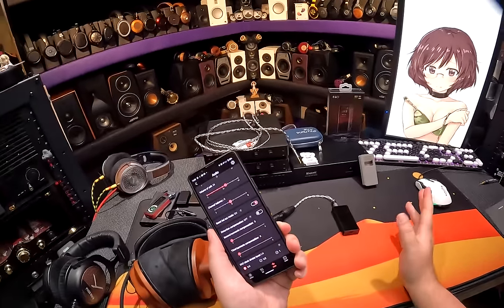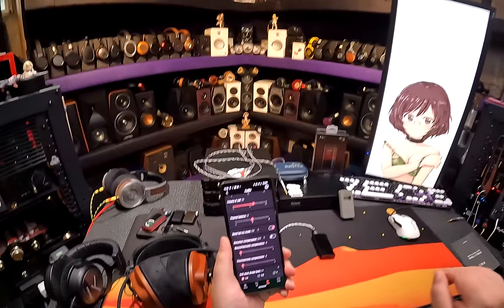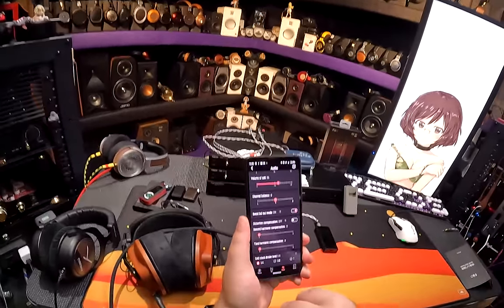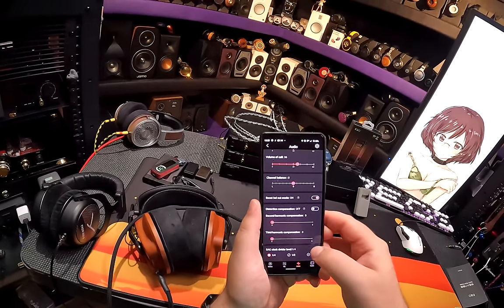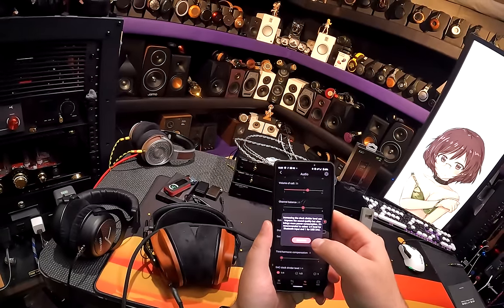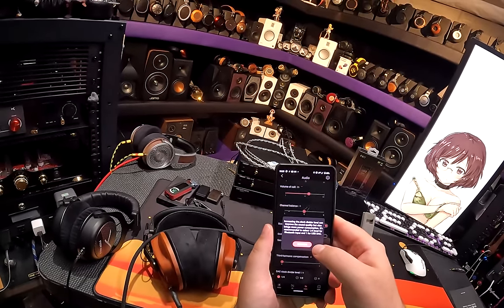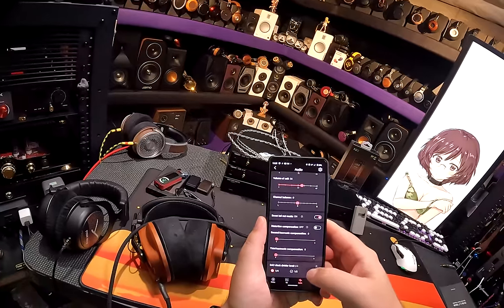This video is already like 30 minutes long. Let's just assume if you put it on to fix something, it'll sound worse, and you got to fix it again with harmonic compensations. And then you have the clock divider level, which increase in the clock divider level can improve sound quality, but brings more power consumption. It is recommended to set it to a 1/4 level for Bluetooth input and 1 for DAC. Well, I'm a psychopath.